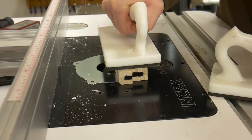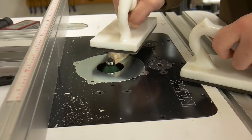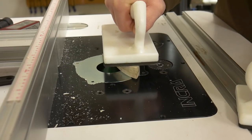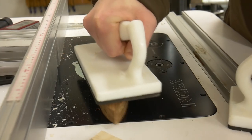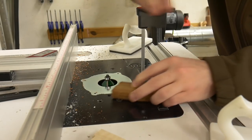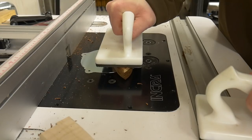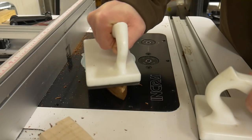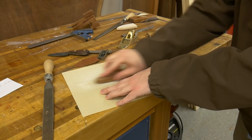The final design element was to put a chamfer on all four edges of the sheath. To do this, I'm just using a chamfering bit at the router table. Since these pieces are really small, I'm using push pads to make sure my fingers don't get in the way. To play it safe, I routed it in two different passes, raising the bit the second time to remove the rest of the waste. To finish sanding the surface, I'm just rubbing it back and forth on a sheet of 180-grit sandpaper.